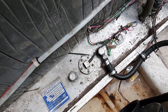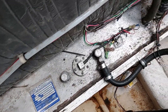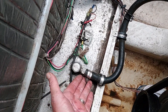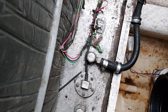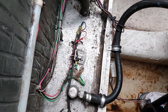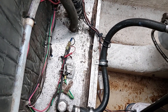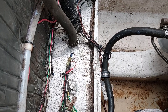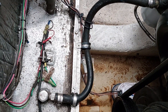What I've then looked at is the fuel system, which has obviously got petrol. It's really important to have good petrol management. So this is an aluminium fuel tank in here. You've got a fuel line in here which is supported, but there's no fuel shutoff. As soon as I opened the lid, I could smell a bit of petrol vapour, which can be quite common. This is one of the reasons why it's so important to run the air extractor on the engine before and after you've stopped it — before you start it. There's an air extractor, which I've checked and it runs, and I ran it for about 10 minutes.